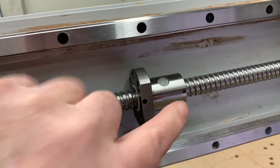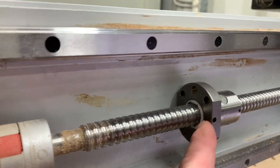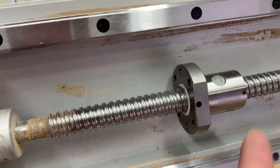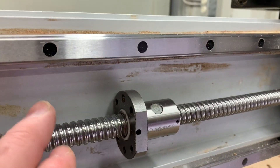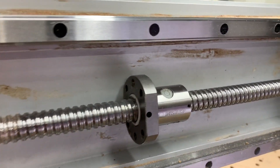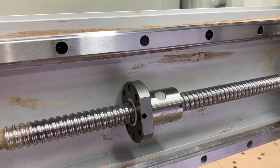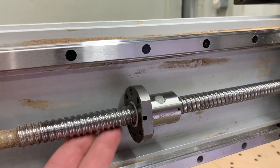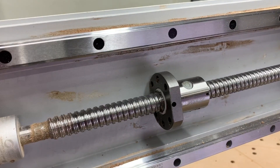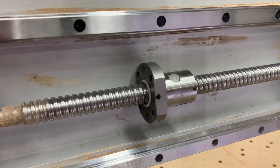There's a hole here, but these are simply set screws — there's one on each side and they hold these seals in place. There's a seal on each side and that's what the set screws hold in place, so there's no way for us to grease this ball nut unfortunately. The only way we can actually lube this is with lithium on a paper towel — spinning the ball screw, I hold the paper towel against it with the lithium, let it work its way in. That's about all we can do here.